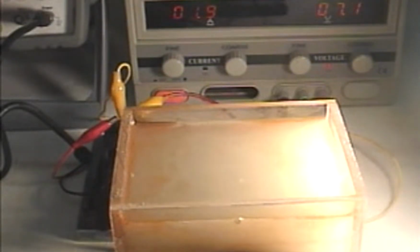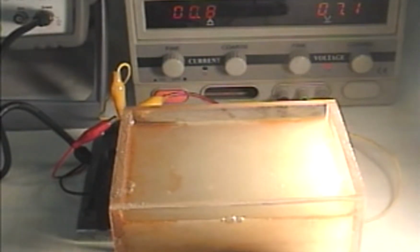As it climbs, I've got to tick it up so that, alright, let me bring it on up a little bit more. Now I'm going to start bringing it down. This is highly sensitive too. Right now I'm tuning at 1/1000th of a hertz. You know you're close whenever it drops down very slowly. If it rises and falls too quickly, you're not close to the matching frequency of the output and reflective energy going back.